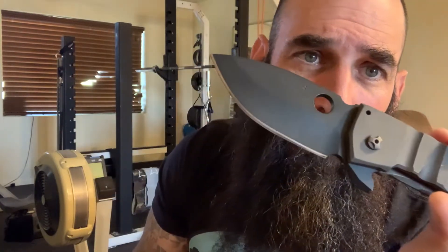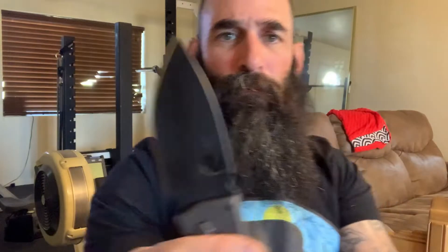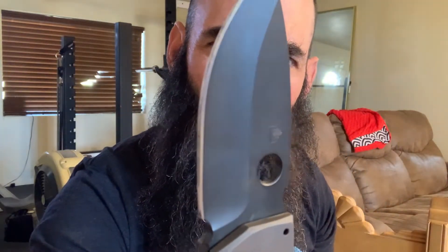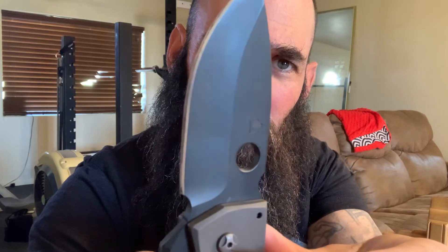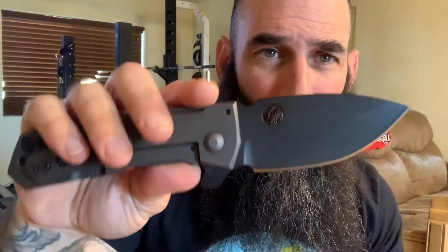There are two main issues with this one. See how you see the black magic marker and then the bevel above it on this finished edge? That finished edge on the top is me starting on the KME at 30 degrees. This thing is a full convex grind, so I'm thinning it out, making it more acute at 30 degrees. You can see it's a really obtuse grind — almost to a point of less usable, put it that way. And it didn't come sharp, so you've got to do something with it right away.